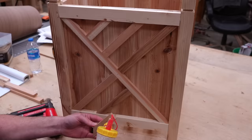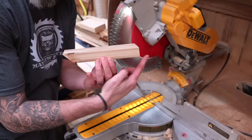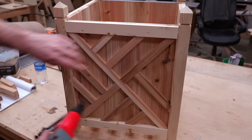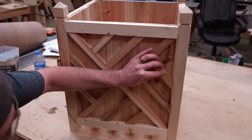For our left and right parts G and I, start with G: set the saw to 47 degrees, make that cut, then reset the saw to 4 degrees — you want the two tips facing away from each other, not leaning in like the V from the previous cut. Same process for the smaller part I — put 47 degrees on one side and then cut the 4-degree angle, again with the tips facing away from each other. I actually like calling those 'angry tips' — it's a lot easier to explain. Install these angry little boards and finish up your sides, and on the very last piece just make sure the glue is on the correct side.